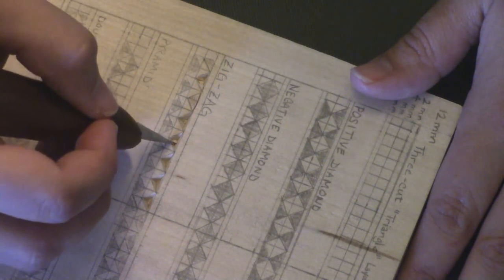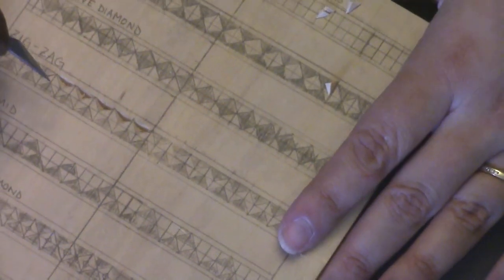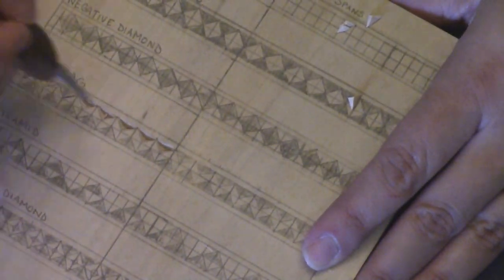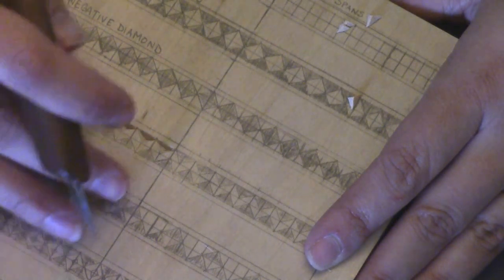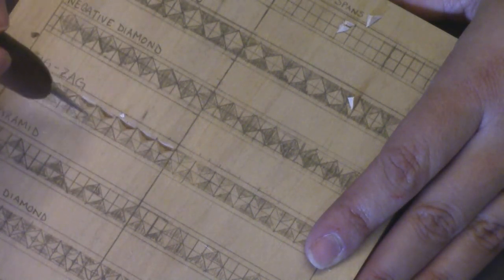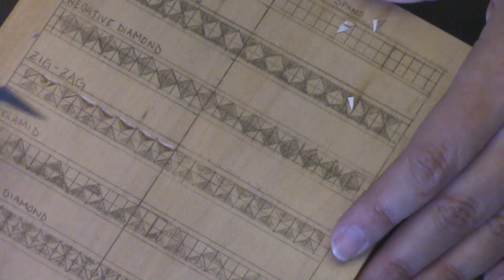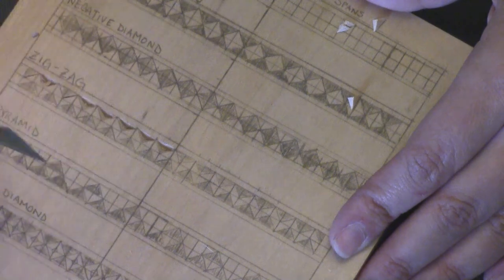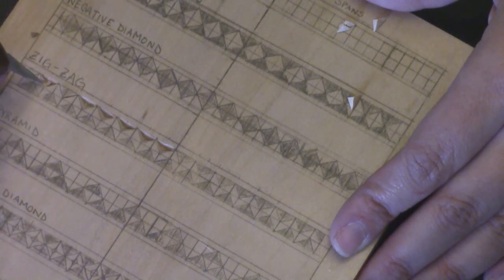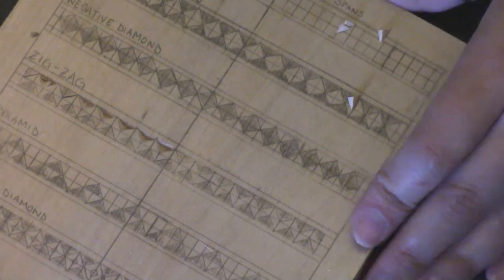And so I just want to take my knife and lay it along the edge of my chip so that I'm only using the point of my knife. And I'm sorry if this isn't super clear to see. And this will, I promise you, be much easier once you're doing this yourself. And sometimes it's helpful to have a light. I like using an LED light when I carve, but in this particular instance I'm not able to use it because it puts too much glare on the board and then you can't see anything.